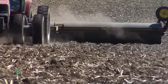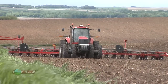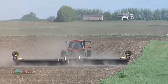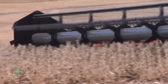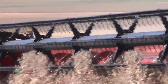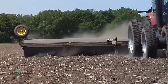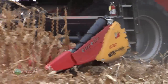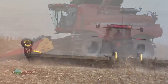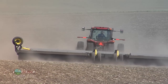Land rollers have become pretty popular in a lot of rockier areas. What farmers will do is they will plant their crop, like soybeans for example, and then they will go and roll that ground — they push the rocks down — so when they are harvesting the soybeans and they have to run the combine head down on the ground, they aren't picking up a bunch of rocks and ruining the combine. In the case of corn, a lot of farmers will roll the ground first, then plant the corn, because they don't have to run the corn head down as low as the soybean head. Either way, they're smashing those rocks down into the ground so they cause fewer problems with equipment later in the year.